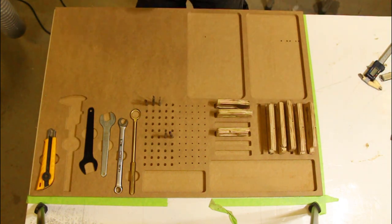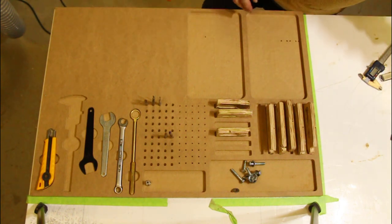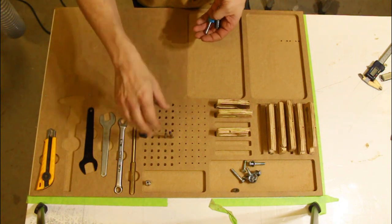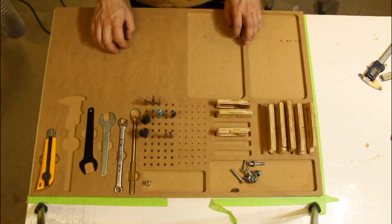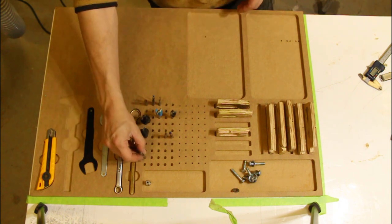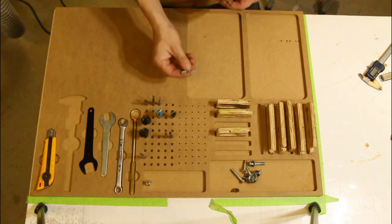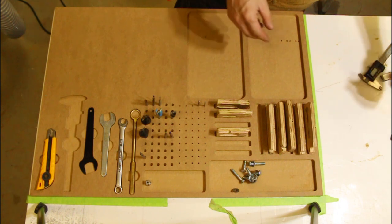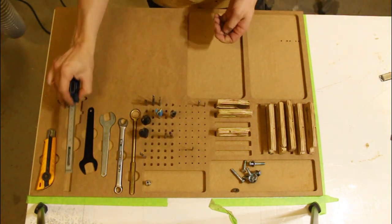And it could be the speed I had it. I did crank it up, like I said before. I went back in and changed the speed. I had the machine going at about 150 inches a minute at full depth just to speed it up. But other than that, that's probably the only thing that I would go back and change. But again, it's just holding them straight. They've got a little bit of a wobble to them. The eighth inch bits are bang on. It's pretty good. Pretty happy with those. So other than that, this is pretty much done.